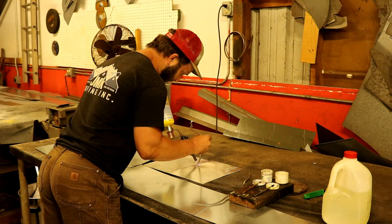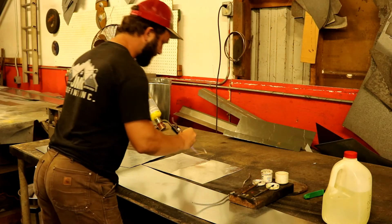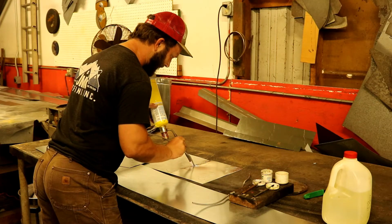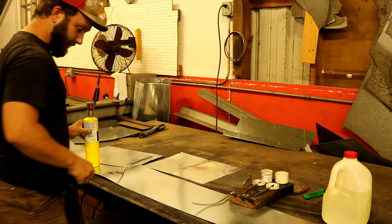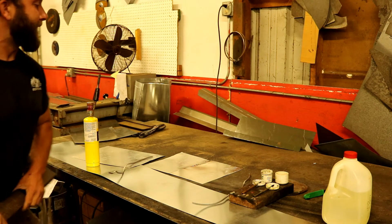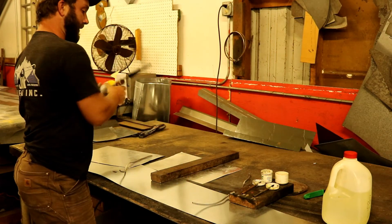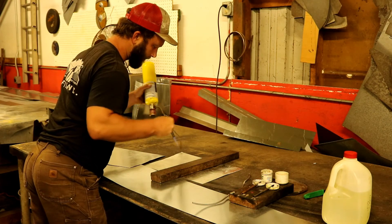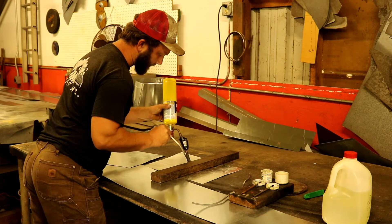I'm moving as I go, readjusting by reading exactly what's taking place. We've got some expansion of the metal, which brings me to another point — when soldering two pieces like this, it's good to use weights. I lay down a nice chunk of railroad steel to keep them in place and continue laying that bead. Both pieces were moving on me, but this will allow them to close the gap.